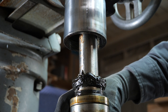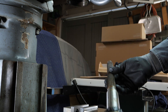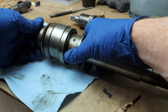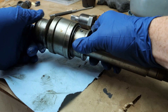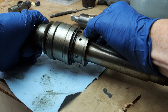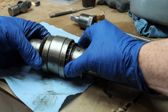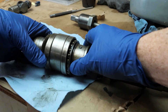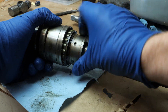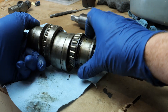You can make up your own conclusions about the best way to keep the bearings lasting as long as you can, but I think very carefully lubricating them with high-quality grease like Kluber grease is probably the best way to keep them going. But if you put any lubrication into that hole, I think it's going to have to be something more liquid that will flow down and pass through the races, balls, or rollers.